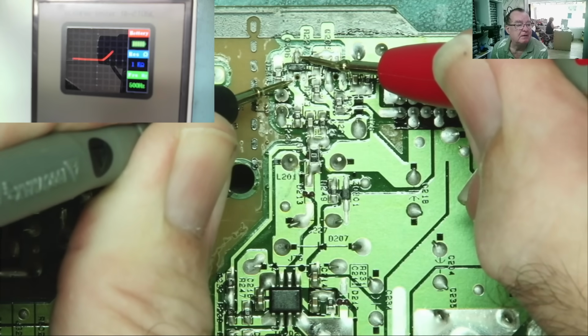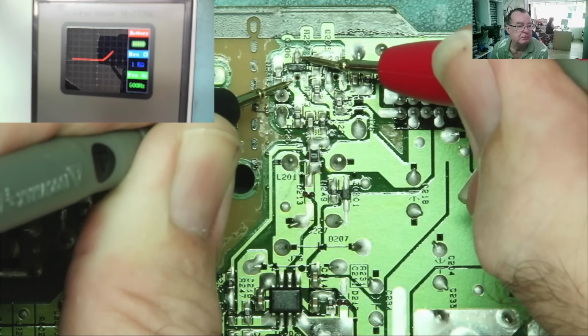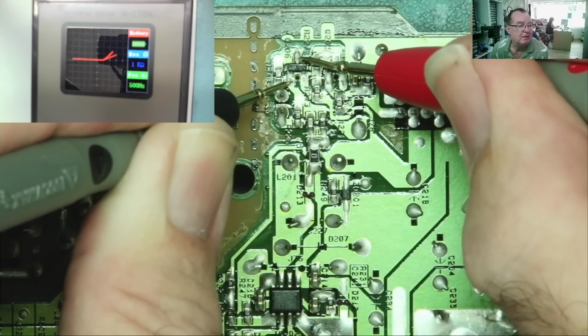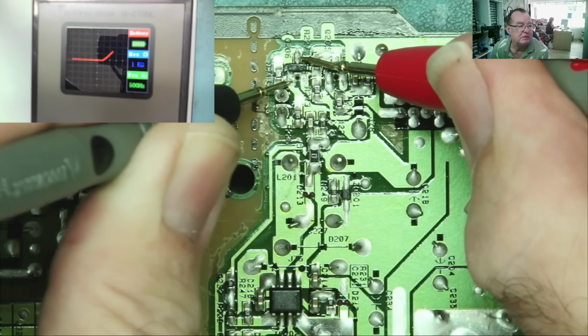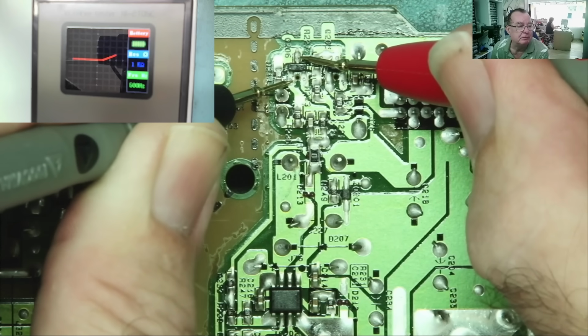So we can see every second the resistance in the positive quadrant goes lower. So as the AC voltage coming in on this one is going more positive, it's conducting more about once every second. That's that pulse doing that, okay? So we can see the transistor is reacting to that.